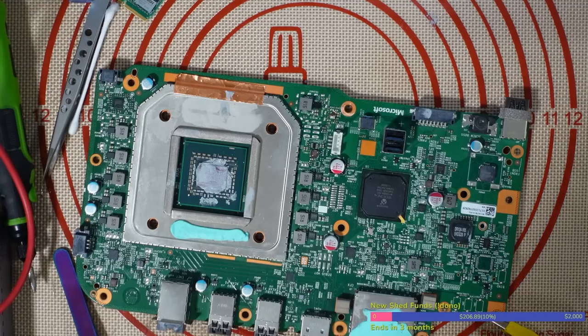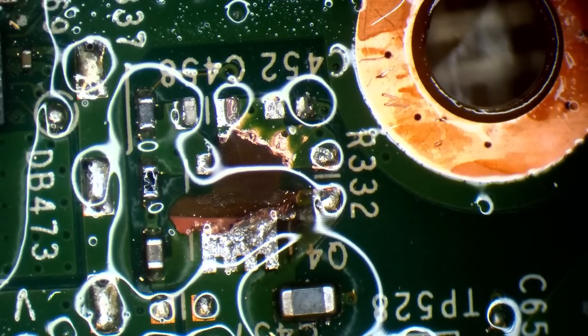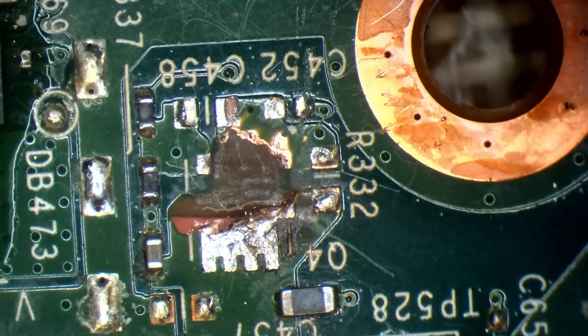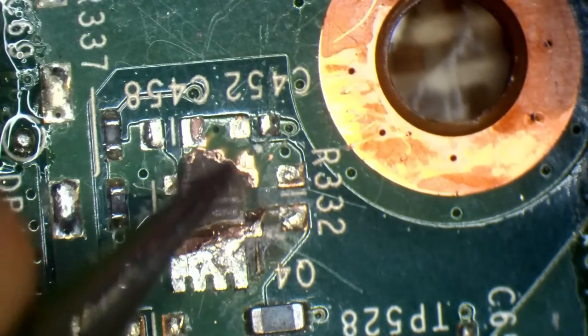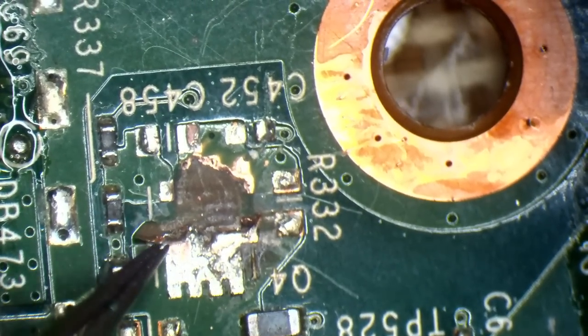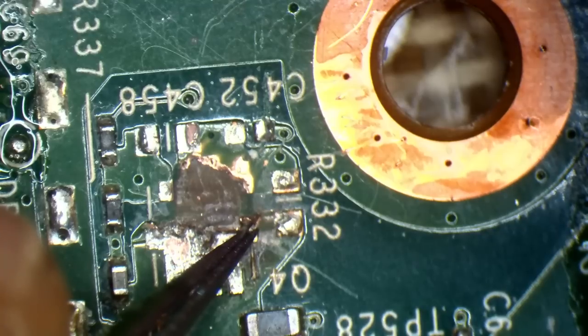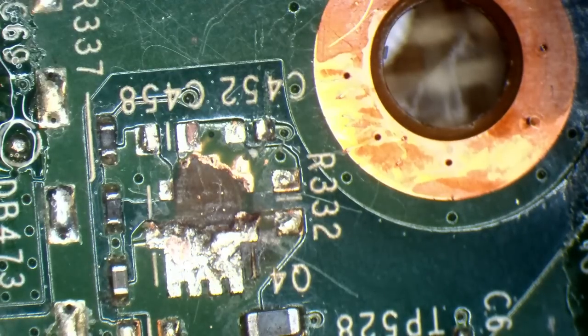If I use a donor board now I should be able to rebuild that circuit. I'm going to put some conformal coating on that area where I've dug away and cleared the carbonisation. I should be able to restore this entire area — the key word is 'should.' The carbonisation wasn't actually that bad. All I've done is took the top layer off where it was starting to carbonise — it didn't get through to the next layer. So I can just push this back down and rebuild the drain pin for the MOSFET.